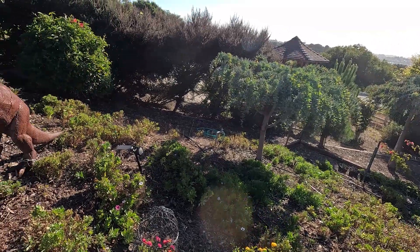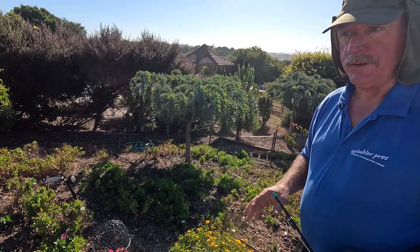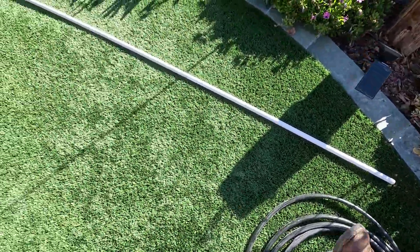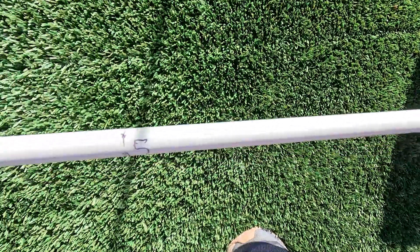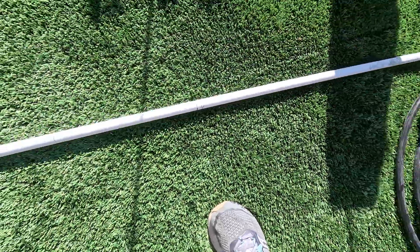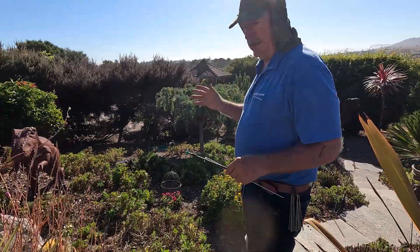To make it easier when figuring out how far apart to put the sprays, instead of hauling a flimsy measuring tape around I made up a reference pipe — I've done this in the past too. I put marks on this half-inch pipe at four feet, five, six, and seven feet, so that's the longest we really want to go. That way I have something rigid to see where to put the next riser.